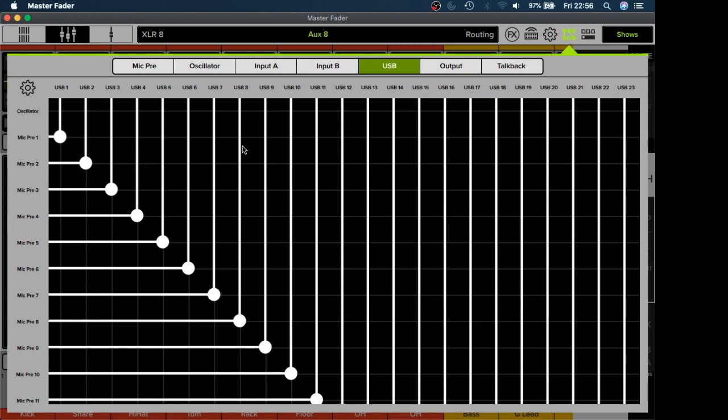Even though you've got all these routing options, it only lets you listen to whatever is plugged into the first two channels of your mixer. It doesn't mean your mix is broken — it's not a mistake. The way they've set these mixers up — and I've seen this with Presonus and Behringer doing something similar — the left and right coming in defaults to mic preamp 1 and 2, and they only send those two channels out through USB as USB 1 and 2.